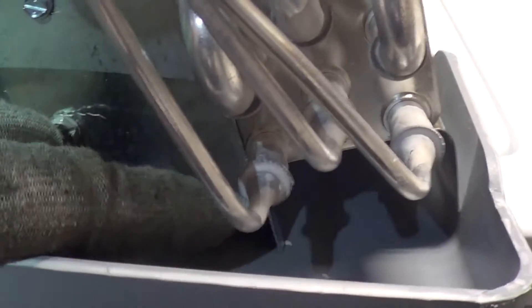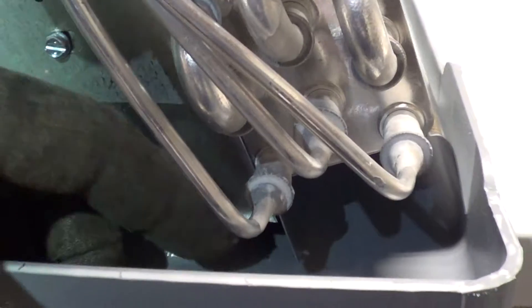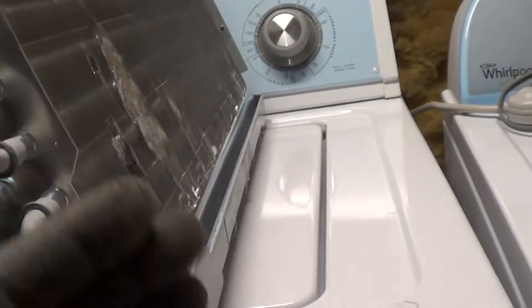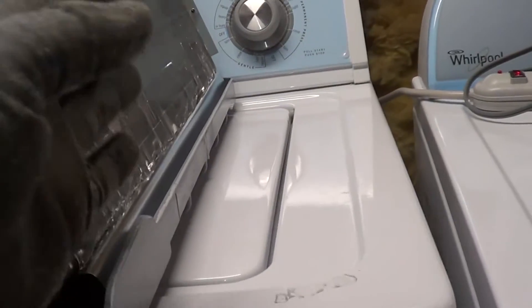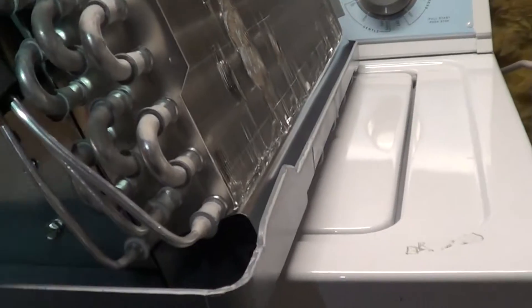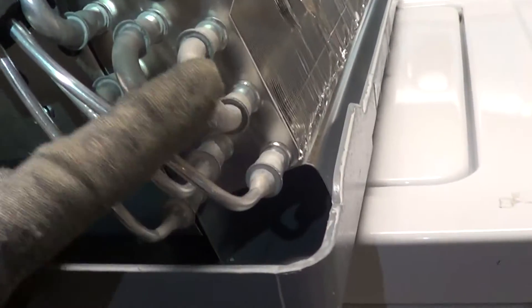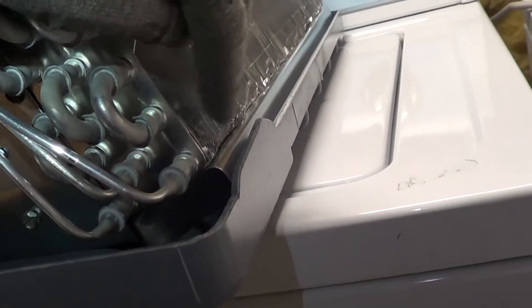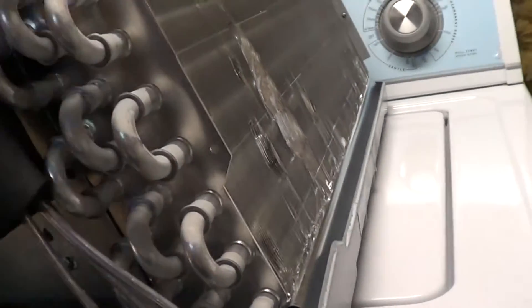You can get some blow-by. Remember the lower pressure is on the outside of the coil here, so it's going to want to kick water splashing out — maybe splash that way. So all you've got to do for your blow-by is just put some little walls — just throw some pieces of sheet metal in there. Don't have it rub on your aluminum pipes. It's fine to touch your aluminum fins because they have a lot more distance for corrosion.